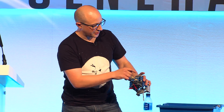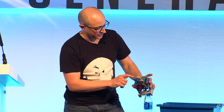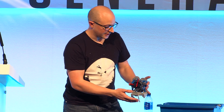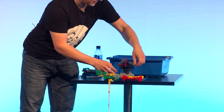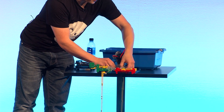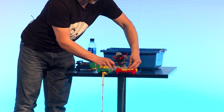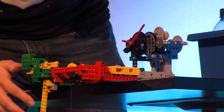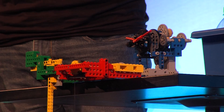These gears over the top are just doing more fractions: divide by 5, divide by 3, divide by 2, divide by 2 — a grand total of 60. So now for every movement of the second hand, the minute hand is going to move at one-sixtieth of that speed. If I attach it to the clock, you can see it ticking away.